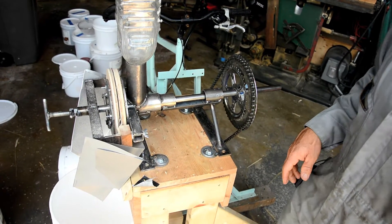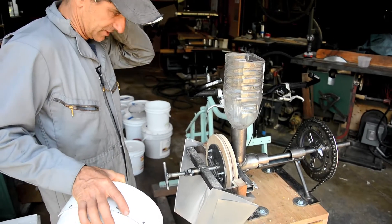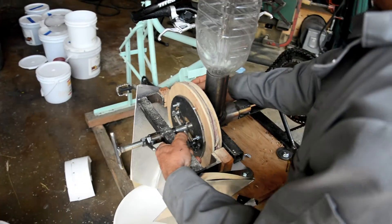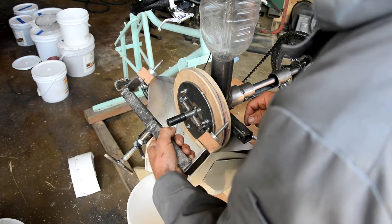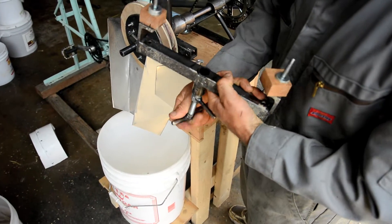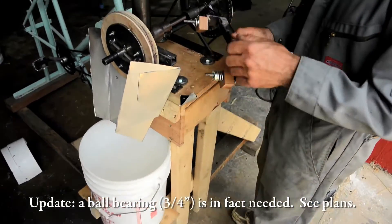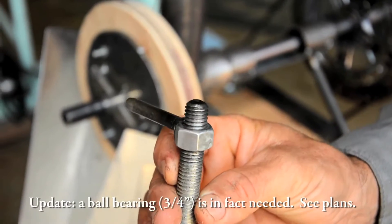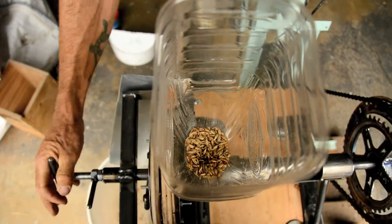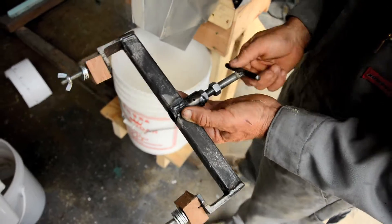Other than that, it's a very standard mill design and shape. As you can see, there's a plastic cowling which prevents the seed from getting thrown everywhere. There is a yoke here that supports the end of the shaft, and normally a ball bearing rides against the yoke. In this case, I've just rounded the adjuster thread, which adjusts the pressure on the plate. The piece of all-thread is rounded at the end and presses on the end of the shaft.